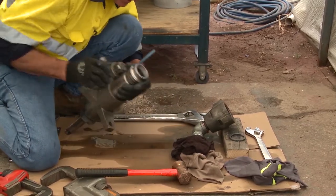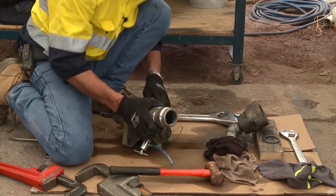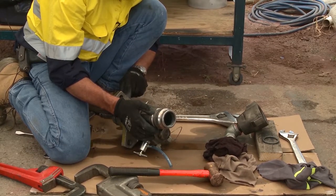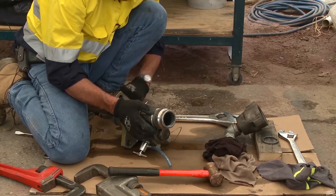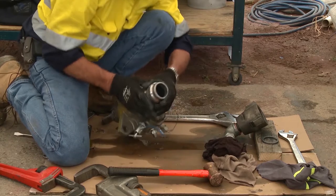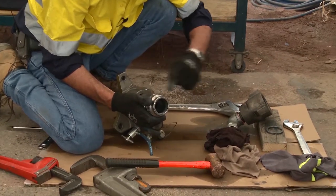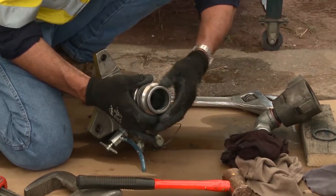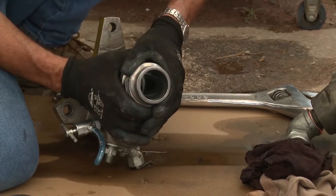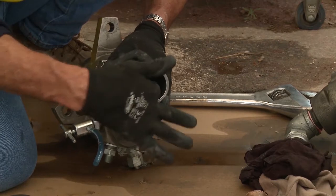This here is your cylinder. What you're looking for in the cylinder is to ensure there's no scouring on the cylinder wall. This pump has static packings and moving packings — the top stack of packings remain in one position, whereas the bottom packings attached to the piston move in and out of the cylinder. That's what causes wear eventually on the cylinder wall. You're looking for scouring in a vertical sequence where contamination has been carried up through the cylinder wall. Also, high wear products like vinyl esters, calcium silicates, and micaceous iron oxides tend to scour the cylinder wall.